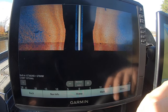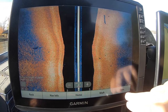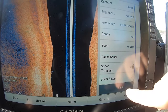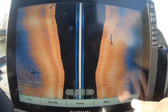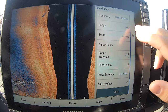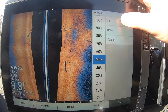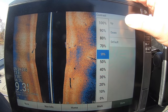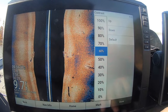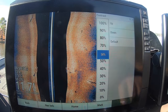We're going to blow this side image box up first — touch the screen, get it full screen. Come into the menu. You can already see some stuff but it's just not real crisp or clear. First thing on our list: contrast. I like to crank that up a little bit — around 59 or 60 — that's going to depend on your lake. You can see how it starts to blow things out a little bit, so we'll back it down a couple and hit done.